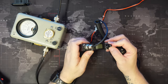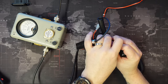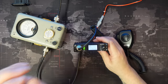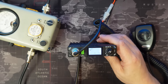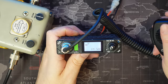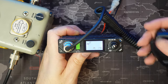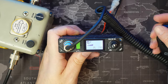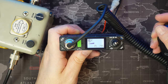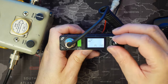And let's just see what happens, if I can get the key combination correct. So into the factory services menu, let me see if I can zoom in on this a little bit. So we have power low, FM, AL, software version, and back to PL. And in the PL power low mode, we're outputting the maximum value there, which is about 5 watts, in its fully adjusted power low position. We do not get a P2 option so that we can dial back the modified power state.